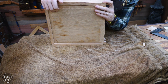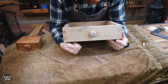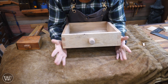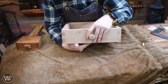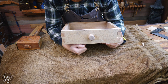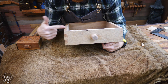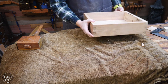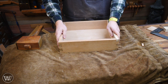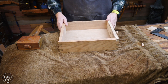I did not smooth out the outside of this box when I did all the other smoothing — I just addressed the inside of the box. Here's the part where I'm going to get people saying 'you did it wrong, you put the dovetails on backwards' — and I say no, I intended to put them on this way. Now if I were to leave this like this without doing anything more, it might eventually wiggle loose, though these are really, really tight in there. What I want to do to actually address these is put a pin through the pins and into the tailboard — so one, two, three, four, and the same thing on this side through the pin into the tailboard. I'm going to go ahead and clamp it all together as if I were gluing it, then I'll drill out the holes. So let me go ahead and clamp this, and once we've clamped and squeezed it tight I can put the bit in and drill a hole all the way through the pin and into the front board, then simply drive in a pin, flush cut that off, and we'll be ready to go.